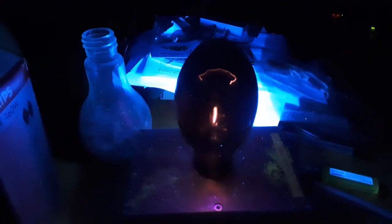The mercury bulb has fully warmed up now at 160 watts. You can see this little cigarette lighter showing up in the black light blue ultraviolet light. From my eyes the filament looks like it's fully faded — as soon as the mercury gas has reached its full brightness it takes over and the filament dims down. It's hard to see dimming on camera, but for my eyes it has. Let's take another good look at that filament.